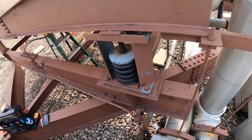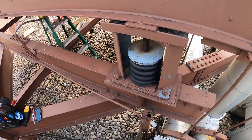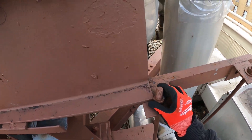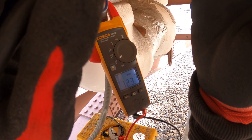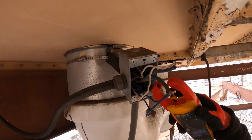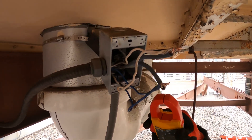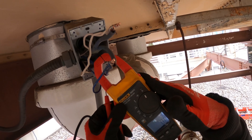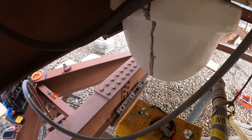To me, we got some bad heat trace. Let me just make sure we're getting power to confirm. If we're getting power and we're not getting amps, and the thing is not getting hot, then we got two bad heat traces. 120 volts — okay, we have voltage here. And we got 0.4 amps — like nothing. We got nothing over there. That doesn't look good.